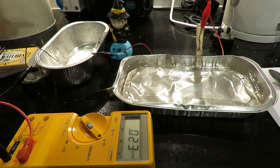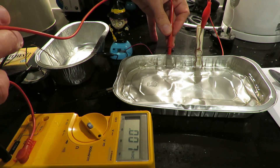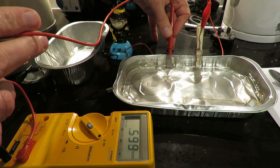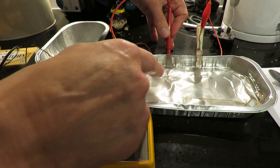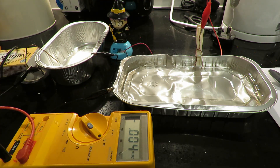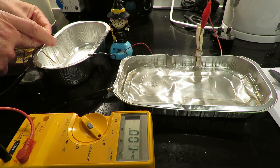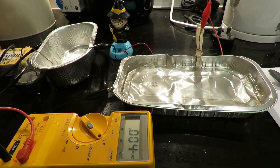So at the moment we probably shouldn't have anything because we're not connected through — we've got a disconnection just here, because that copper wire is hanging in the air. I'm still measuring about 0.6 volts. How's it doing that? It's still measuring that one because that one's still connected. So I shouldn't have my meter connected just there — I should have it connected there, because that's the same place as there.